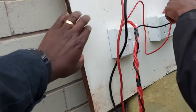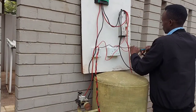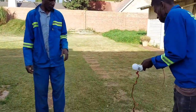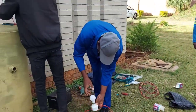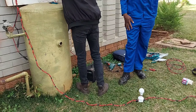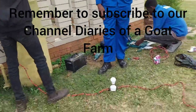All you need is a hardboard — just an old hardboard — and then you buy some light switches depending on the number of lights you want, then a plug, an inverter, and a charge controller. You also need some electrical cables, those normal lamp holders that you buy in the shop for about a dollar, and normal lamps. I used LED lights because they are only 5 watts. The other thing you definitely need is the battery.